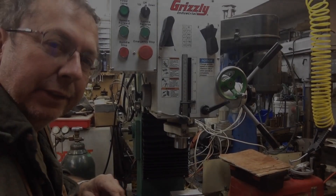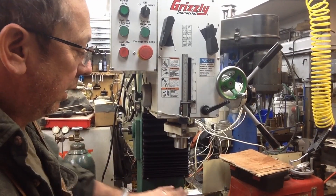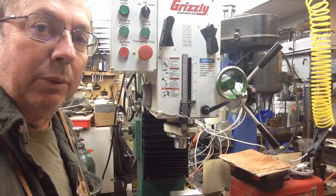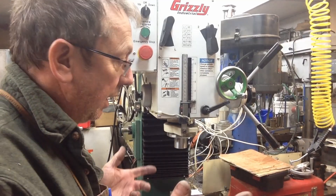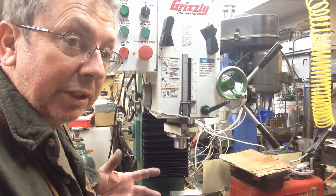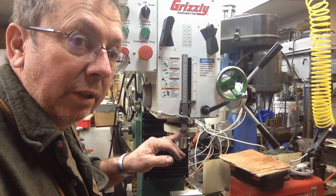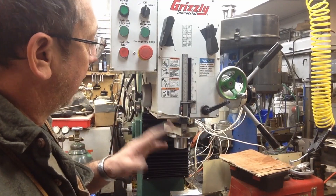I didn't show all the installation on the last two axes of this DRO - a little bit interesting but not a tremendous amount - so I went ahead and got them mounted. I still have to mount the head, which I think I've figured out the permanent mounting solution for, but I don't have it up and running yet. The Z-axis scale uses the same scales I had, just drilled and tapped at the bottom, the same way I had it installed on the G1007, then installed to the faceplate here.